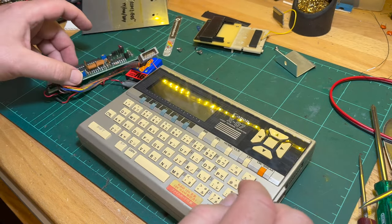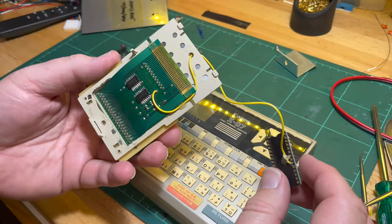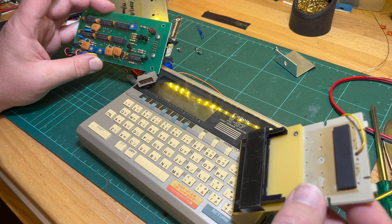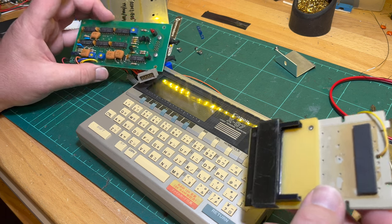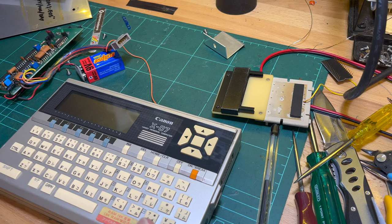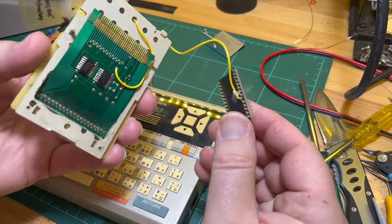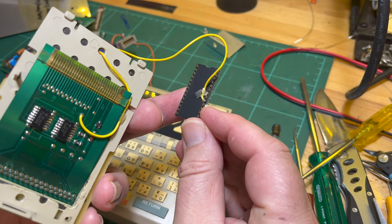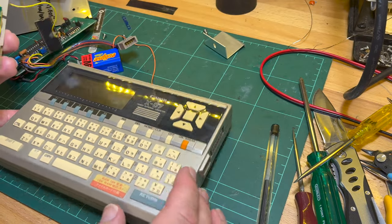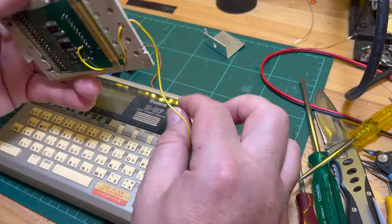Right, I just need to go and have a look. I want to see what pin 20 of that chip is, and find out what these MC14001B are, they're also date coded 86. All right, so I've done some research. So this hooks up to chip enable one, CE1, which is active low on the expansion RAM, which is a TC5565 8K. So that's what that does.